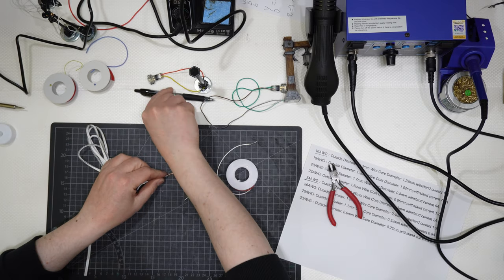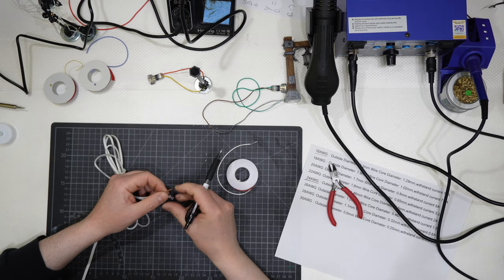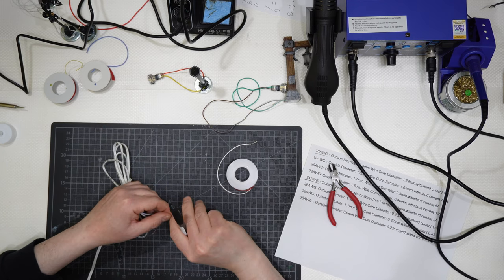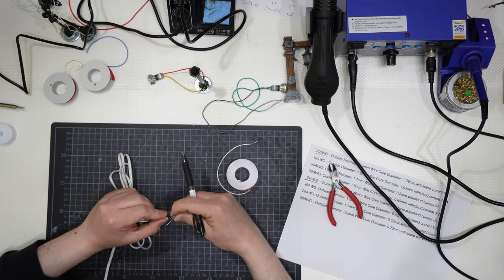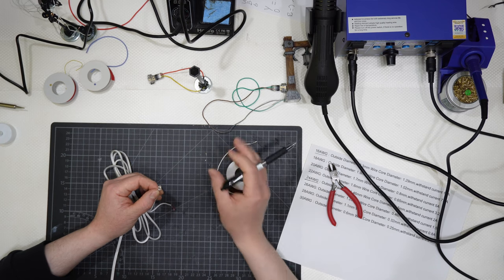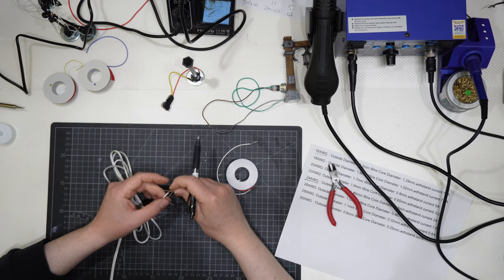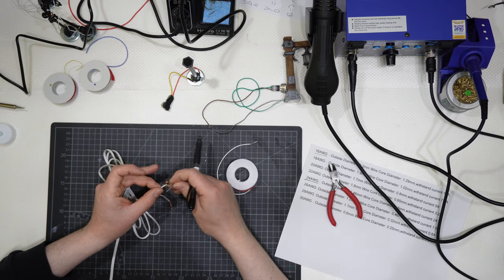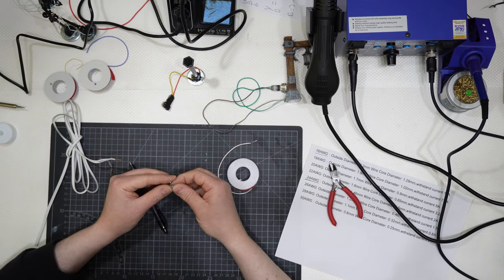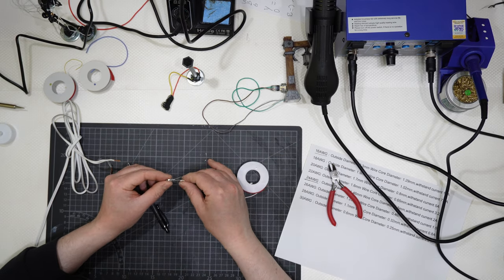To a leg. Here I have the wires and here I have the leg. How to connect them? Obviously I can roll the wire around the leg like that, hoping that it will stay until I've completed the process of assembling the entire street lamp. But it's not suited, it will be easily removed. That's why it is better to solder the wire and the LED.